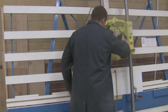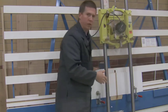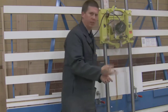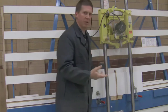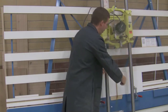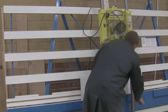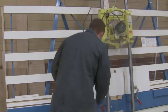Lift that out of the way and it leaves a nice clean dado — a nice clean groove top to bottom. You saw that I let it run all the way up and all the way down. If you go too fast it'll tear pieces out, ripping through the board instead of slicing through it. Too slow and it may start to give you a burn. With a nice sharp bit it's pretty easy to go fairly quick. It does clean out as you go back across on the downward stroke. When you're done, unlock it, move it to where it needs to be next, lock it, and repeat.